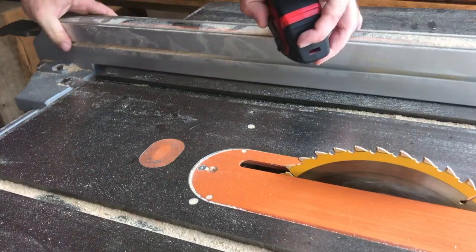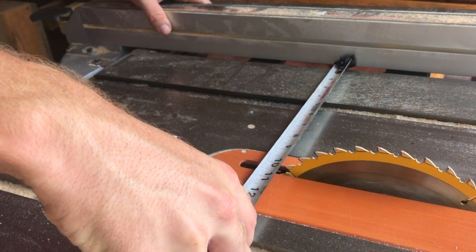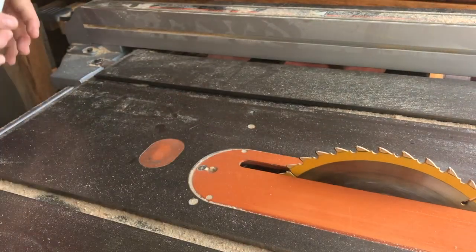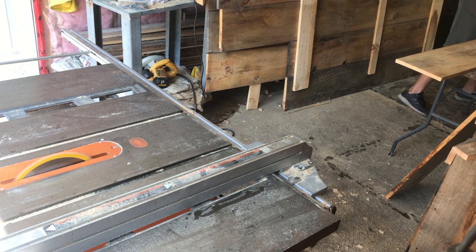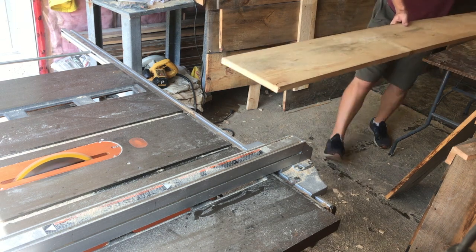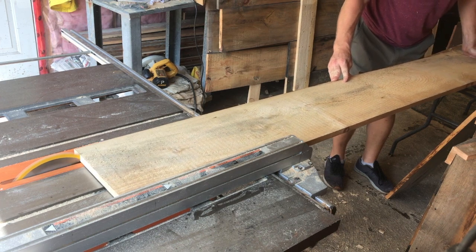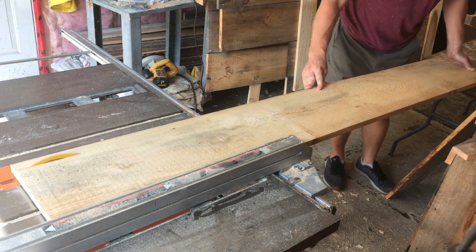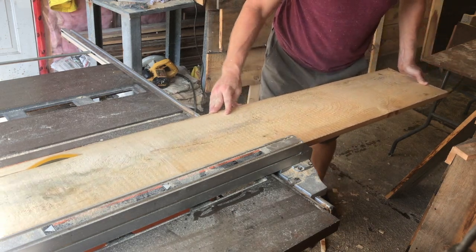And for the width of this pantry, I have to somehow make 4 pieces of this pine look relatively the same width. So I'm cutting 3 of them down to 10 inches, and I believe my number was 37.5, so I got 3 of them at 10 inches, and then the last piece will be 7.5. So they're relatively the same, and it's a quick, easy number to use to keep things simple.